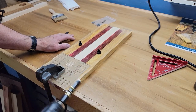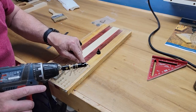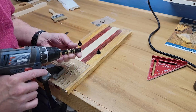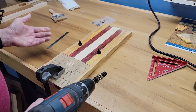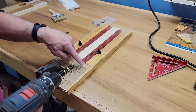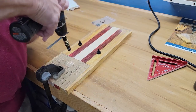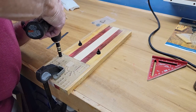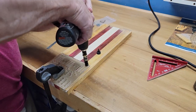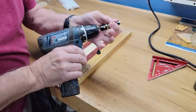What I've tried is a few different things. I've tried to start the drill slow just to make that first cut into the wood through the tape. I've tried it at a higher speed, and I've found that it all depends on the type of wood - different woods take the drill bit differently. That's the bottom line. With the clear packing tape, it gives you a good opportunity to see what you're doing. After I get them started and I can see that the hole has a nice clean edge, I bring the drill up to full speed before I plunge it down. Depending on the wood, you're going to do a lot of cleaning out.